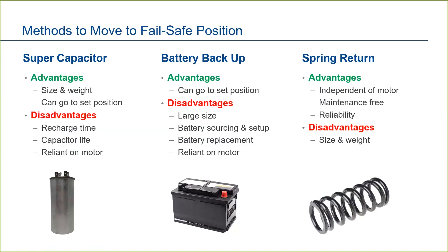Battery backups are another method to achieve failsafe on an electric actuator. We can also put backup electrical systems in this same category. An advantage is that a failsafe position mid-stroke can be achieved with this technology — say 42% open, for example. Disadvantages are the large size and extra cost and effort required to source and set up a battery backup or redundant electrical system. Batteries also don't last forever and need to be maintained or replaced, which can be quite a task in remote applications. And again, like the supercapacitor, a battery backup system is still fundamentally reliant on the motor and electrical system, so if there was damage to that system, a battery backup may not cause the actuator to stroke.